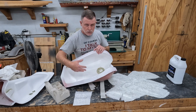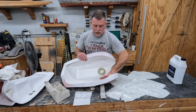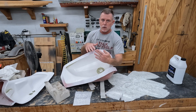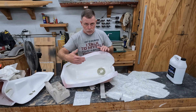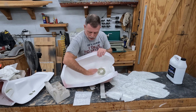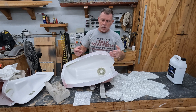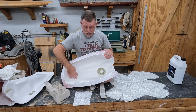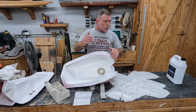We'll do this side of the tank first. I lay up one half at a time because the mold has to lay on its side, allowing excess to hang off. If you laid it directly upright your material will collapse in on itself because of the weight of the resin. So I lay it up on its side, do one half overlapping the centerline, allow it to cure while still green, then flip the tank and do the other side so the overlaps bond together well.